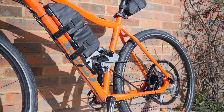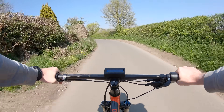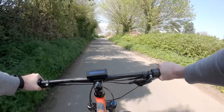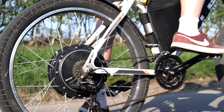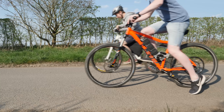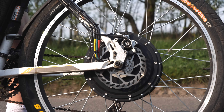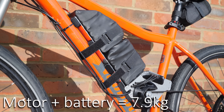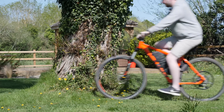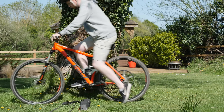So would I recommend you build an electric bike like mine? The 3.5 kilowatt motor performance is great, allowing it to accelerate to 30 miles per hour in a few seconds, with a range of about 30 miles of fun riding and even more when cruising. But if you just want performance, hub motors are the best option — a 3 kilowatt hub motor is super quiet and has better acceleration, though it is quite a bit heavier at 9.3 kilograms compared to my whole setup including battery at just 7.9 kilograms. Hub motors will fit into pretty much any bike frame whereas mine needs a very specific design. One big advantage of mine is it can be converted back to a regular bike in about a minute by removing the battery and taking the belt off.